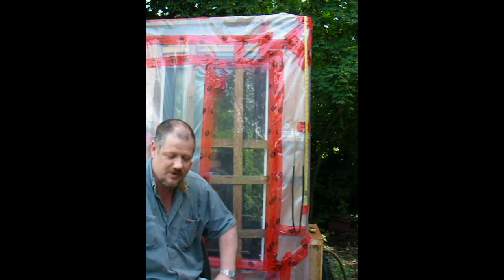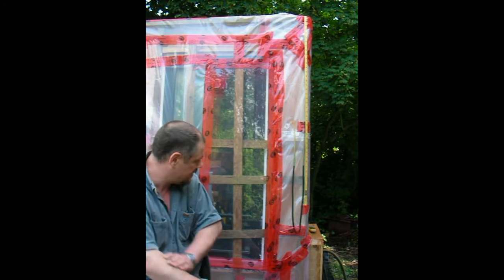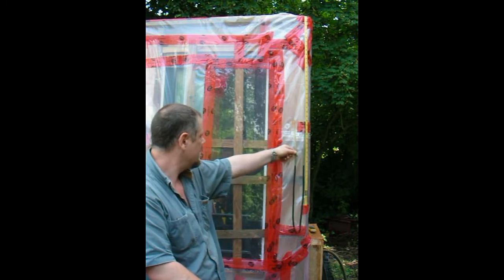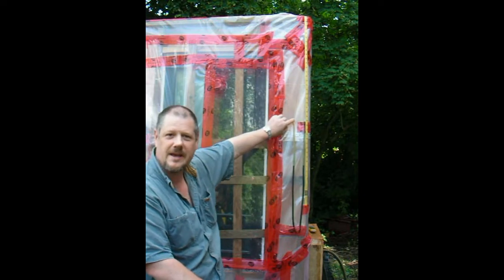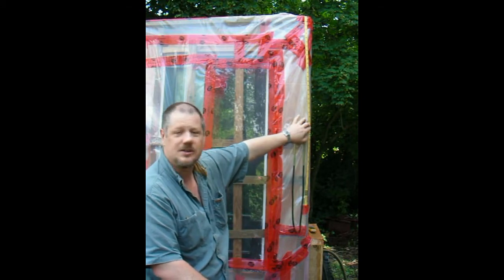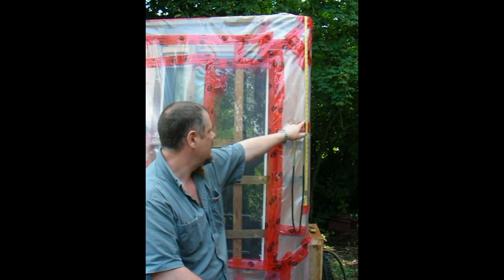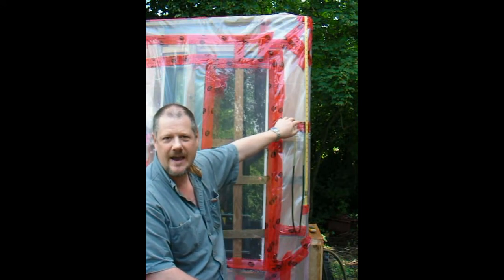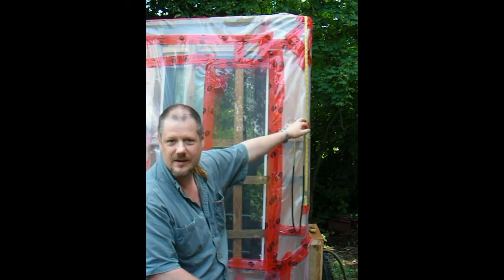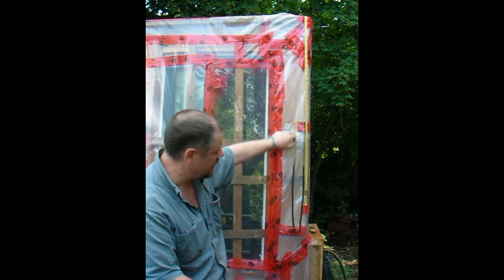Thanks to Graham Finch from RDH, who's one of the instructors, he showed me this nifty little trick. I've got some rubber tubing. I've stuck one end of the tubing into the assembly. The other end is just loose to atmosphere. It comes down and loops up at pretty much the same height as the exterior air intake — at the same height as where it's penetrating the envelope.